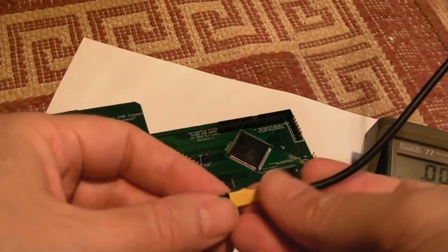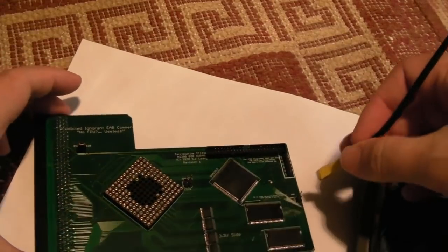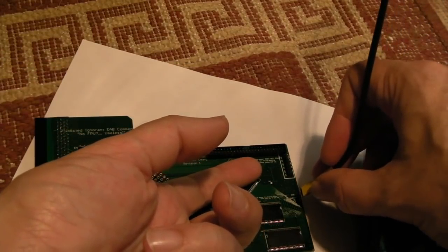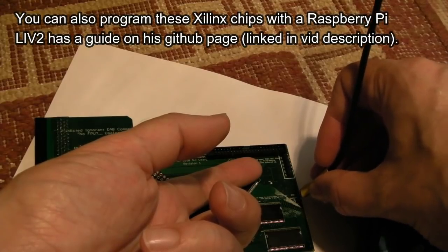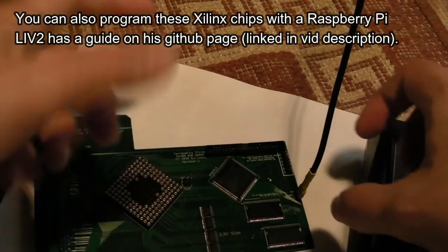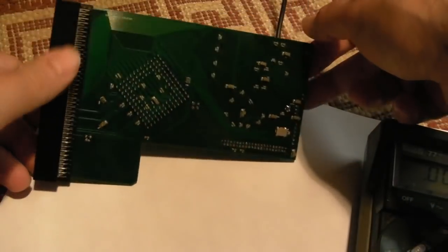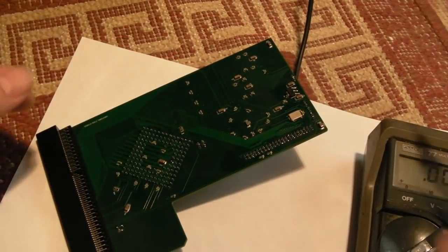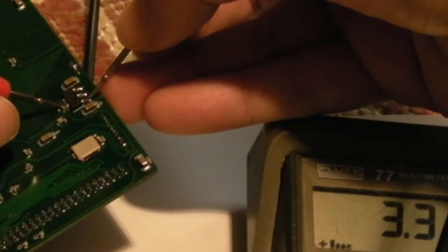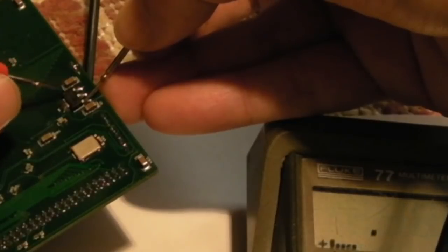So I'll start by doing my usual thing. I've got a jumper in there, look. Powering this. Ground at the top. And I'm just going to put my finger on there while I do this, actually. Very carefully connect that up. Hang on. There we go. Just make sure, because what I want to make sure of is nothing's going nuclear here. And it isn't. Just flip this over and measure on volts DC. Yeah, look, plus 3.3 and I think 5 volts in, yeah.